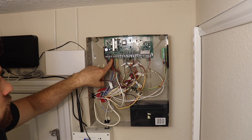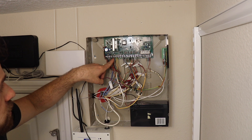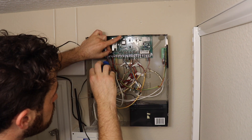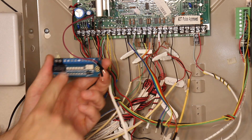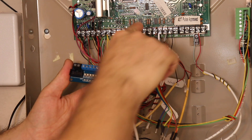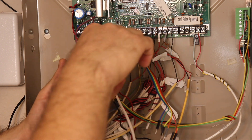Terminals 4 and 5 already have a bunch of wires in them powering the keypad downstairs as well as motion sensors and glass break detectors — it's basically a 12-volt auxiliary supply. I'll loosen that up and connect from the top since it's already crowded. Now let's hook up the interface module: we've got the voltage reference black and red connecting to terminals 4 and 5, and then zones 1 through 6. Your kit comes with a mini screwdriver perfect for these little screw terminals.